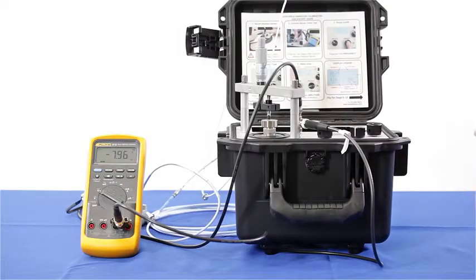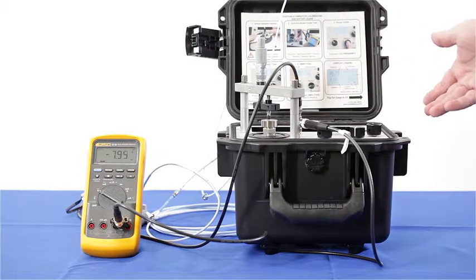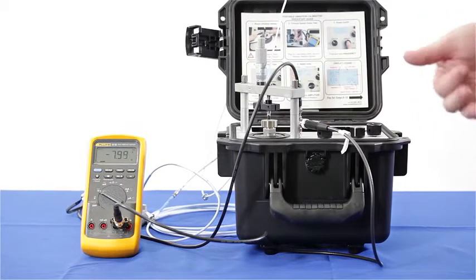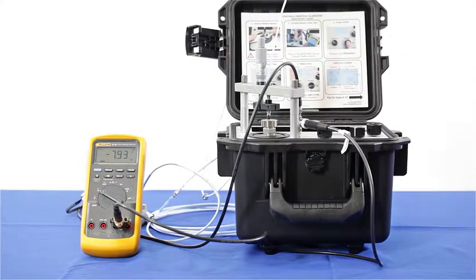Here's where relying upon gap voltage can actually cause increased dynamic output error. The incorrect system with five and a half meters of cable has caused the gap voltage to drop to negative 7.9 volts. It started at negative 9 volts, so if I walk up to my data acquisition system and press the gap voltage button, it's going to tell me that my gap voltage is a little low.